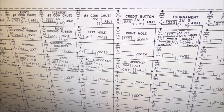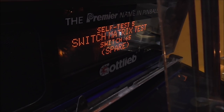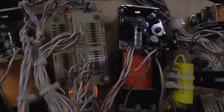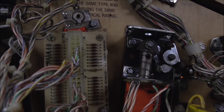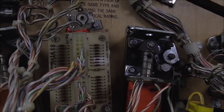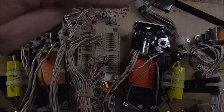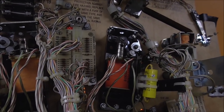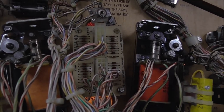We're just going to go on the back and check all the diodes with the multimeter — they're all 1N4148 diodes. I checked the diode board and there was absolutely nothing wrong with it. Upon closer examination, the diode board is actually split in two, and on the back it's split in two as well. The plugs are the exact same size and everything's in the exact same place, so the diode board is actually two identical diode boards. I used the multimeter and checked all of the diodes — they were all fine.